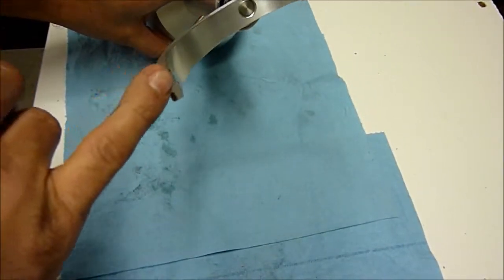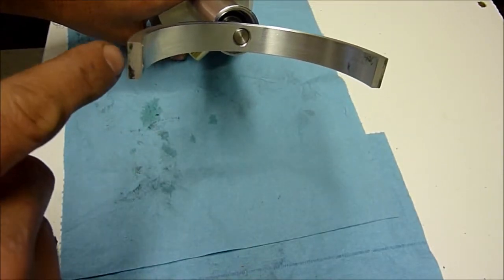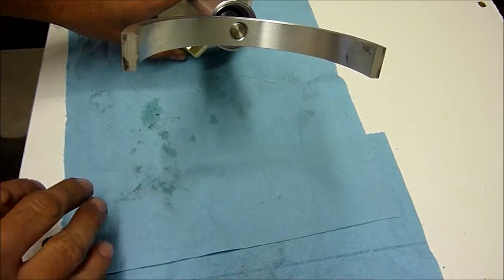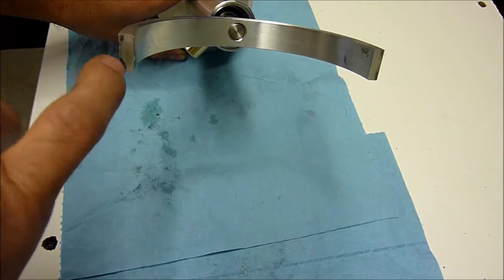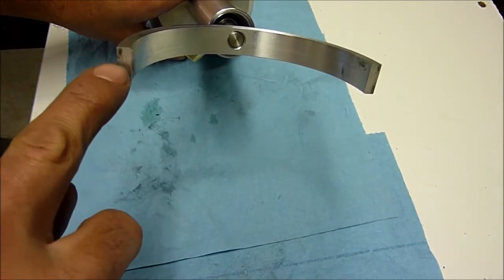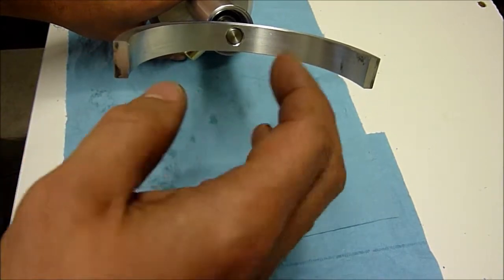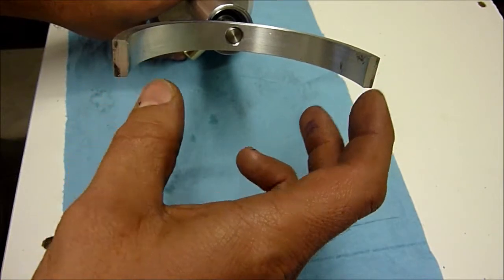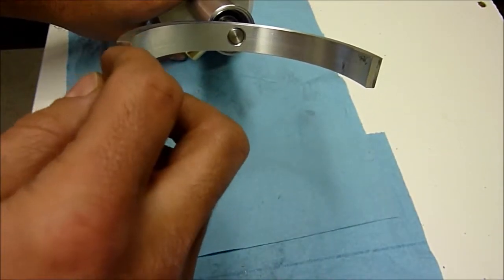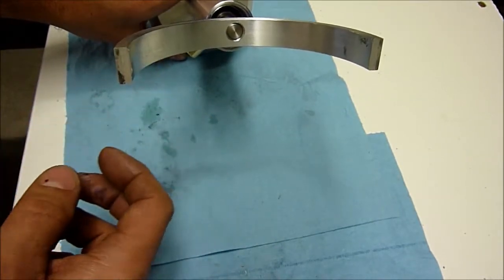And then on top of here, we need to machine these flat, these two surfaces, and then we'll probably make a brass cap with some really small screws on there, and then notch, just machine a little, probably a V in there to hold the next gimbal and allow that gimbal to rotate this way. And then you can just snug those screws down on that, and maybe we'll do a bronze bushing or something in there. We'll have to see.